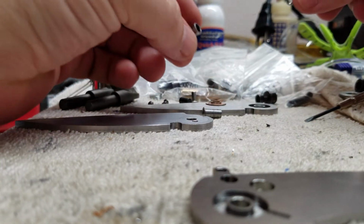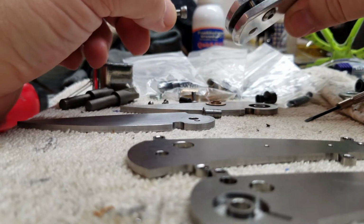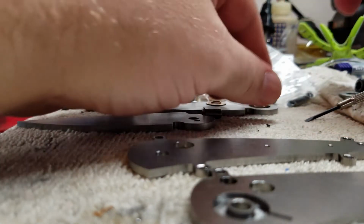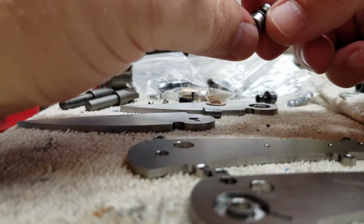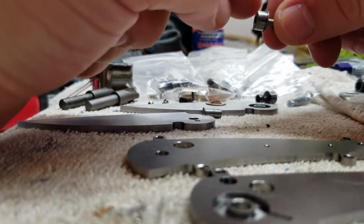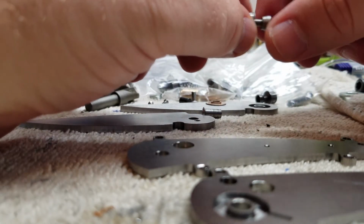As long as I'm using these bigger buttons, I'm always going to have to have that thickness. I don't remember exactly how thick this one measured up to when it's all done, but I did take quite a bit of material off the face of the button. I took a bunch of material off the face of the button on the first revision prototype, so it's not nearly as long, but that didn't change the fit up between the collar that's up here and where the taper is. All I did was remove material from this end, and I will probably plan to do that with this design as well.